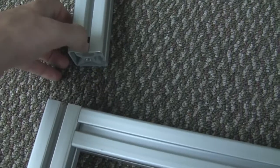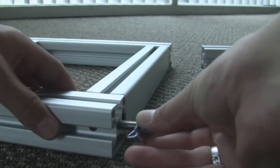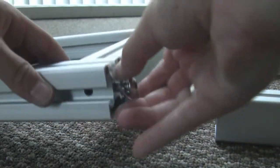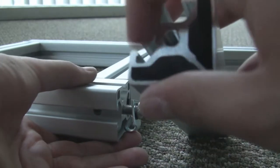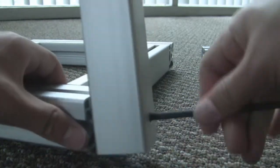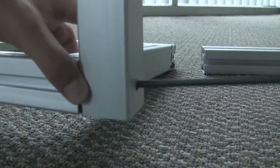Taking the shorter pieces that have a hole at the base, you're going to do the same thing with the end fasteners, screwing them in and putting the fastener up in here and tightening them on. Take the end fastener, screw it onto the three T-slot piece. Taking the piece that has a hole, make sure that there's a T-slot towards the frame and towards the center. Slide it on and use the five millimeter screwdriver to attach it.